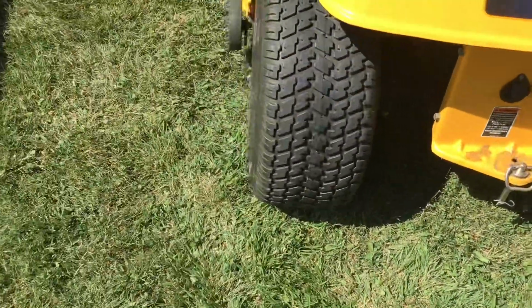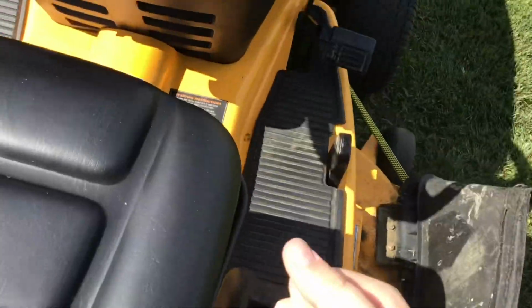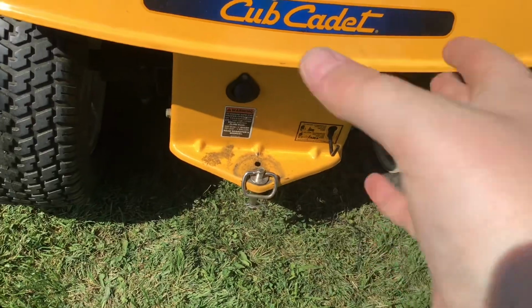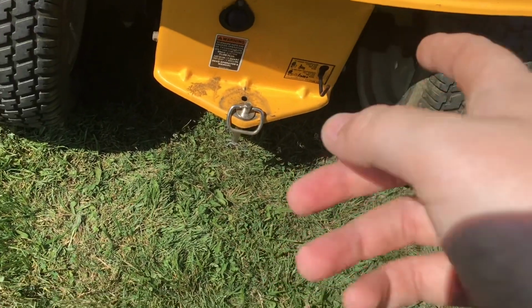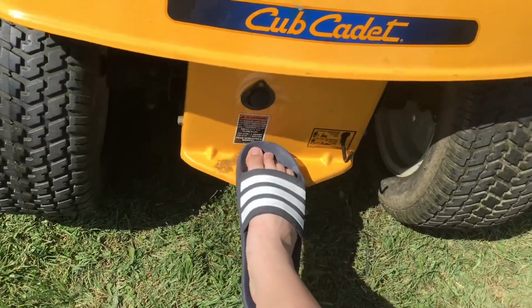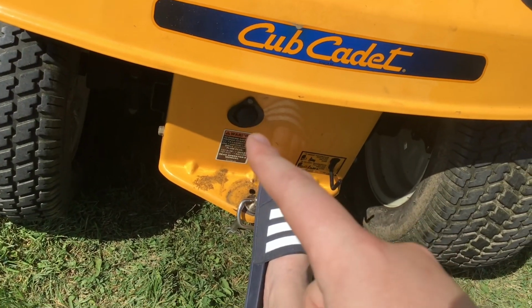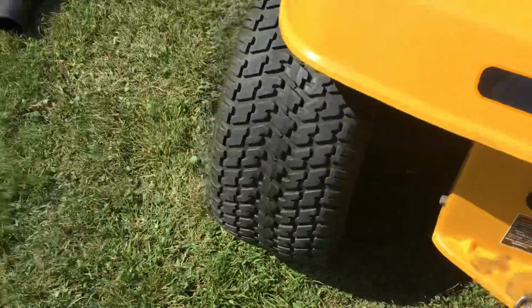But I feel like they could have that same system with just a push down, push up. Maybe even on this side is an option where you push down or you push up for an electric sleeve hitch. And what it is they have an actuator, because the top link doesn't have anything that goes to it, so they could just have a top link already. You just get a different back plate, but you have the top link that attaches to it. Your dipstick can already be there. You can still have your hitch. You can still have your disengage for your hydro, and your dipstick for your hydrostat. And you just have 2.